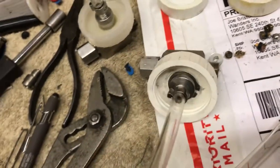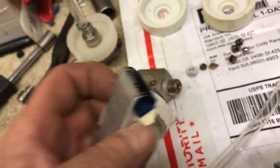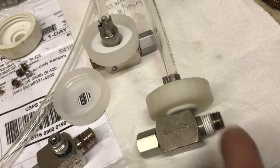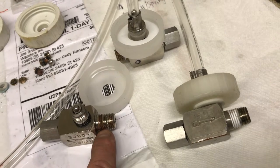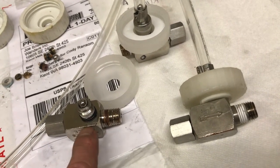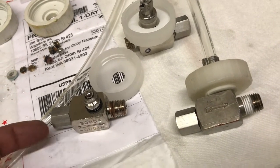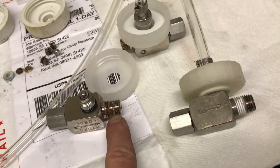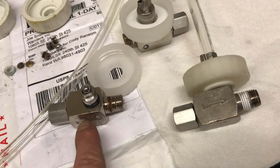This one is state-of-the-art except it is brass — see the zero? That's a magic marker mark I put on there. It flunked the life test. I use this gauge here to help me determine the size of the opening on the front of these injectors. This is what determines the ultimate life of an injector. If this opening gets too big, it doesn't matter what's going on inside — it won't draw. There's got to be about a 30% drop in pressure on the output side; water's coming in, water's going out. If there's not that 30% drop, it won't draw.